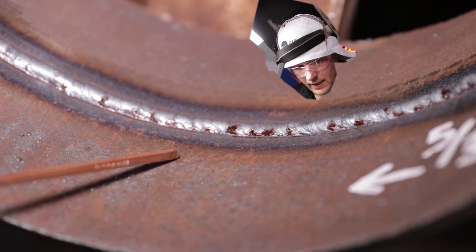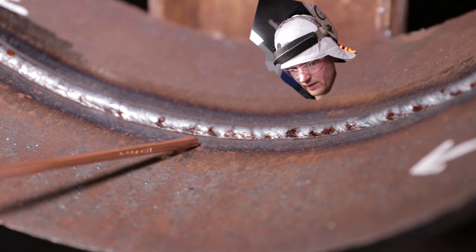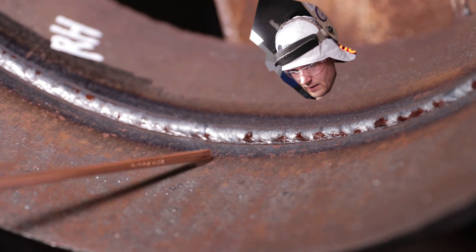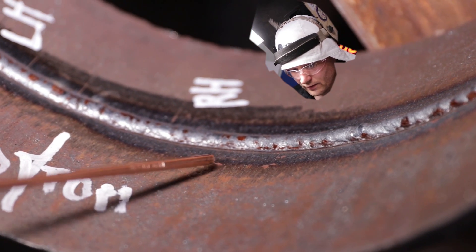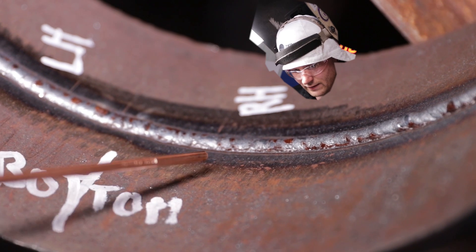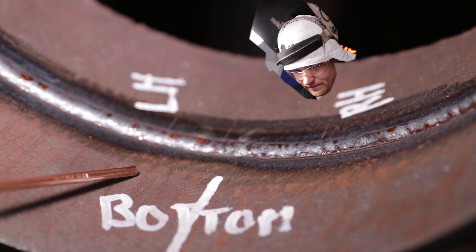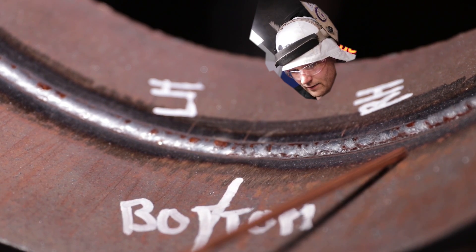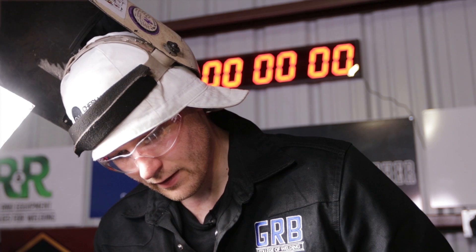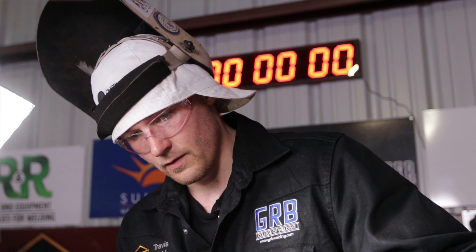Coming back around the pipe — I believe this is silicate or silicon covering the weld bead; I cannot remember the difference between the two. I was using 70S-2 and 70S-6 for the 1/8th and 5/32 beads. We're back at the bottom: this side is the right-hand side, this side is the left-hand side. And this is the root pass on this pipe, done with 5/32 and 1/8th filler metal.